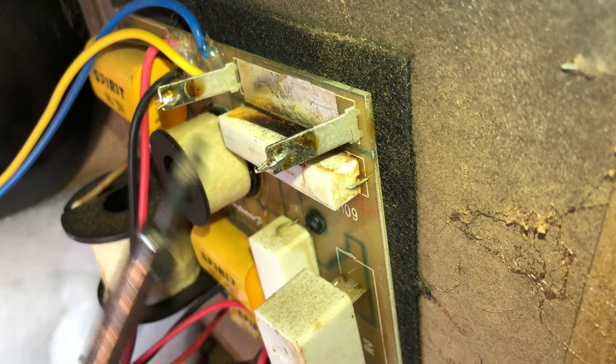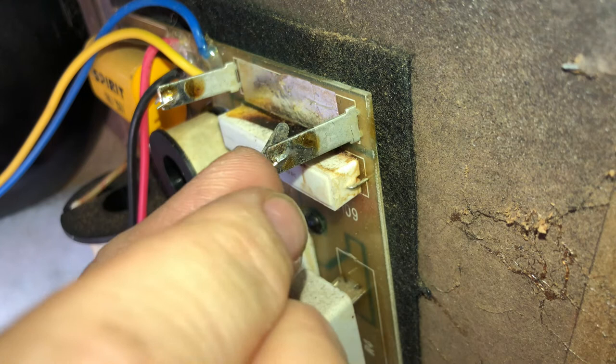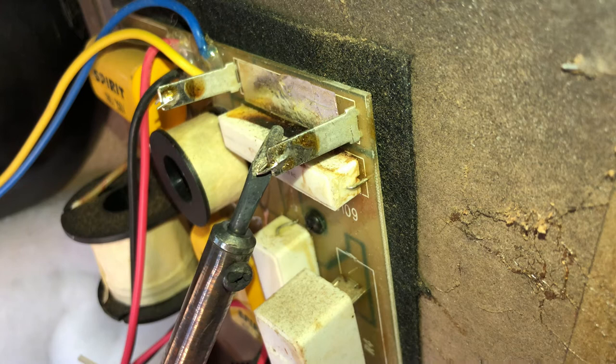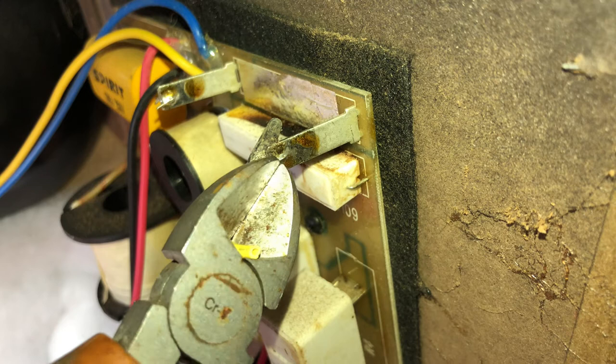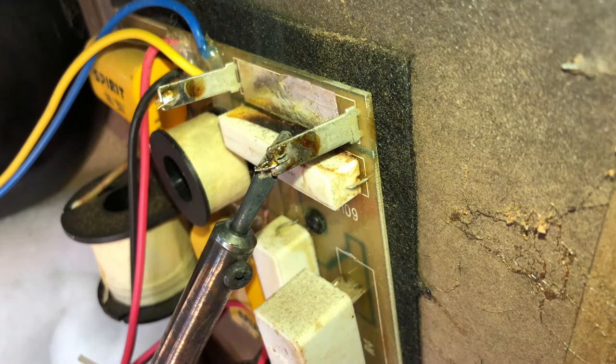Tell you what, see if this works while I'm here. So I'll get the soldering iron now, warm the solder up. Once it gets warm, in a minute, up where my finger is, that bit I've left on, that very small bit, that should come loose. I'll have to pull it out. So once it starts bubbling now, I can just get it. These aren't the best things I'm using. Let it get a bit hotter first. Yeah, that's loose now. See, that's moving now. So I just try.